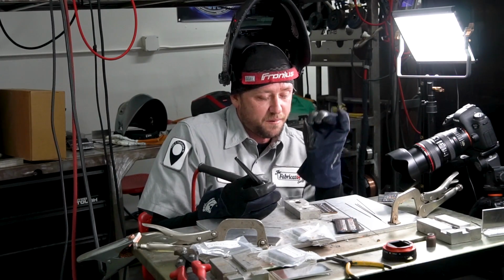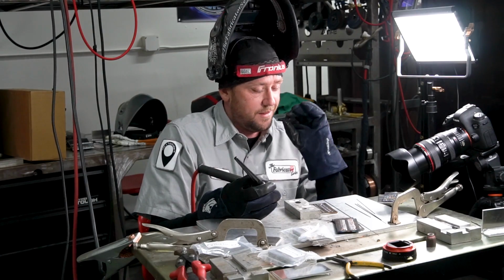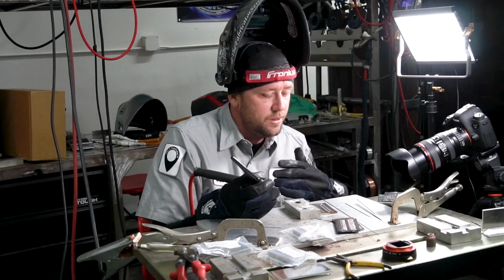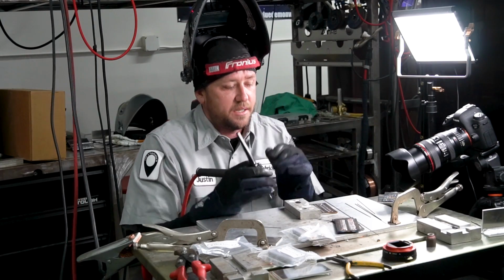And that weld pool, if the result is it is freezing, solidifying as you're moving, then it's just right. You don't want your filler rod to get stuck in there. You don't want to be really tense. You want to be nice and loose. You want to have your hand move nice and free, everything just nice, clean, smooth. All we're doing is just tracing those lines out.